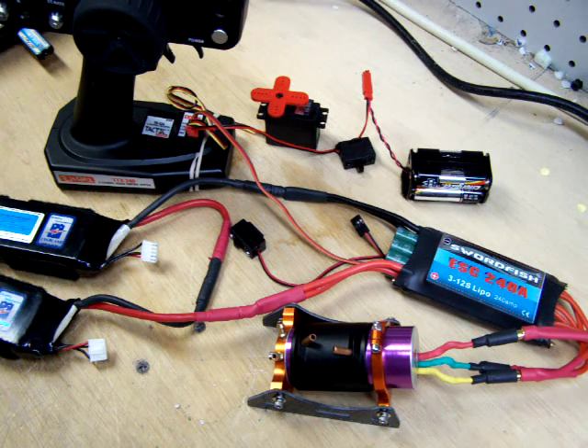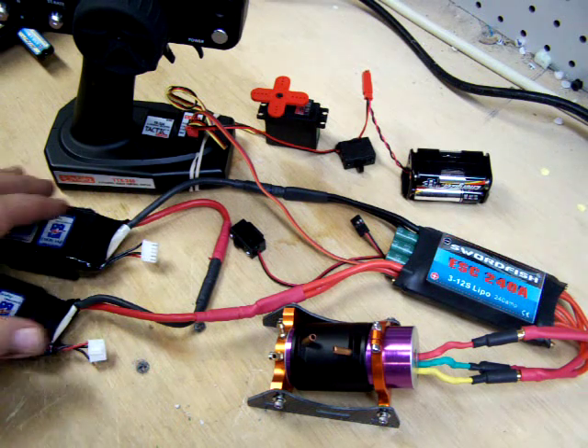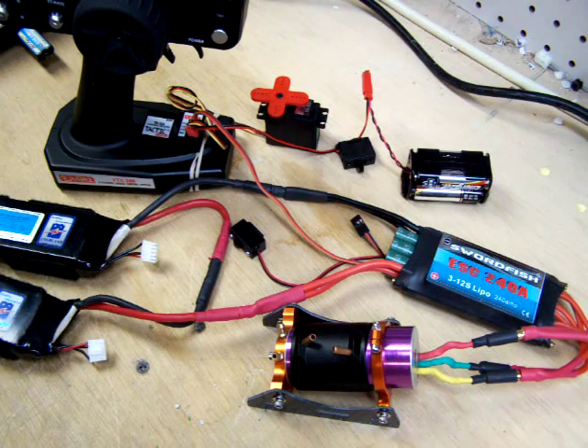We're going to need an external battery pack or an external BEC circuit. The Swordfish does not have an internal BEC built into it. I choose to use a basic 4-cell battery pack for this. I also have two 2S packs in series connected to the motor. It's important that you use at least 4S because the LVC on the Swordfish is pre-programmed at 12 volts — if you don't use 12 volts, you won't be able to power it up.